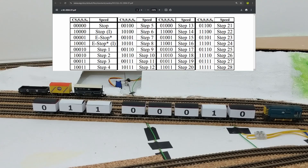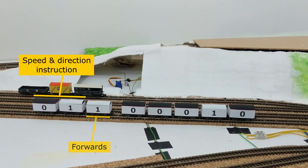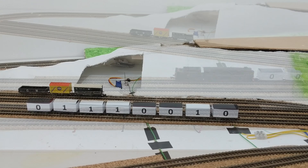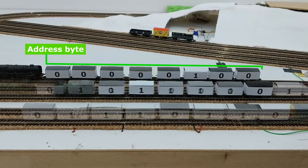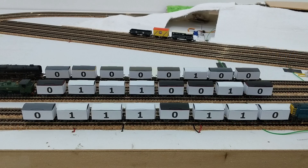In this video I just want to focus on the values I should expect to detect from the tracks. The first two bits of the instruction byte are always 0, then 1, and because my controller commands were for forward speeds, the third bit should always be 1. Using the speeds table, the remaining five bits for speed step 1 should be 00010, and for speed step 2 should be 10010. After the instruction byte comes a 0 bit, then 8 bits for error detection. The error detection byte is calculated by XORing the address and instruction bytes — if one or the other bit but not both are 1, the corresponding error detection bit is set to 1. After the error detection byte is a single bit with value 1, which concludes the baseline packet.